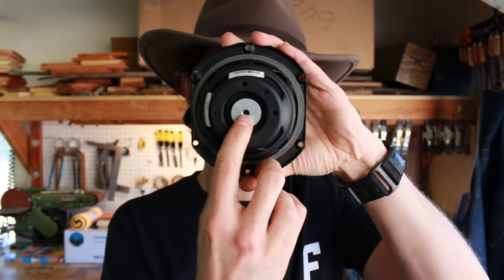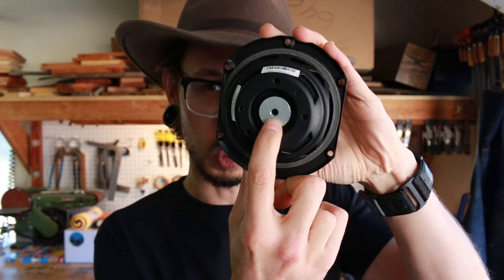For passive radiators — I don't have a huge amount of experience with this type but I have made a few. On the back of passive radiators there's usually a little threaded hole that you can put a screw into, and the best way I've found to add or subtract weight is to add washers to that screw. Add a little more weight and it'll lower the frequency; take a few off and it'll raise it. Be careful not to add too much weight or it won't move at all. Find that sweet spot — it takes a little trial and error but it's not that bad.